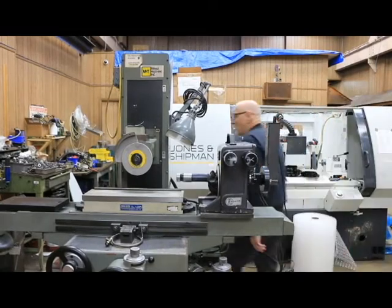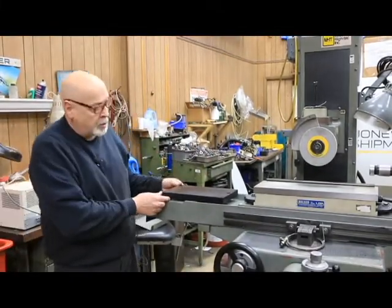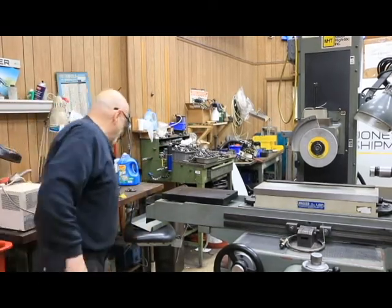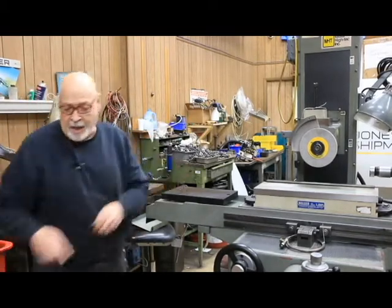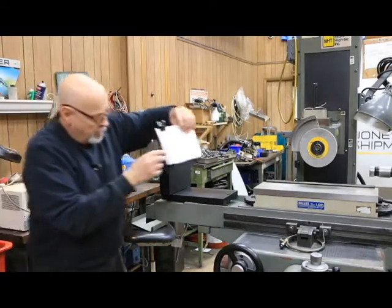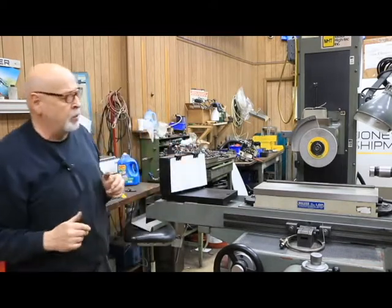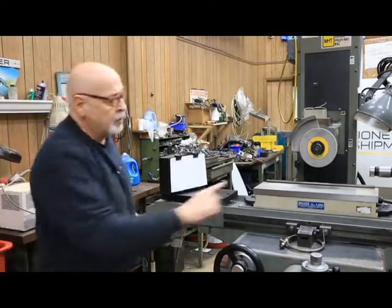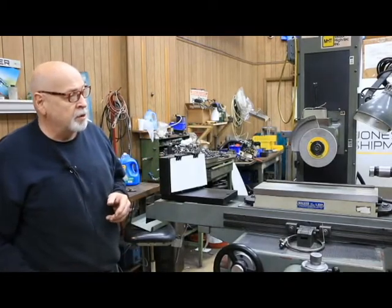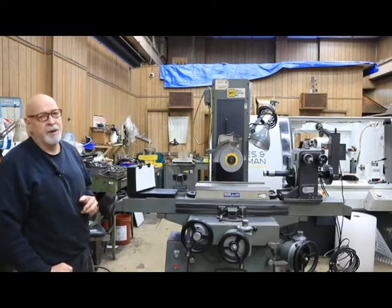On the other side of the machine we've got this reflector plate. I told you it didn't really matter exactly where it went, but it's heavy - it's a three-quarter inch steel block - and it has to go up here. There are some long screws that are going to drop down and bolt this to that. Then you've got your little swivel gate that drops into a little hole right here, and a little screw on top. This distance can be anything you want - it's not critical. The only thing critical was what we spoke about: the focus. I would set this all up loosely, look at it, and don't drill any holes until you figure out what you want to do. A lot of people have scratched their head over this.